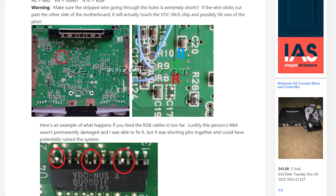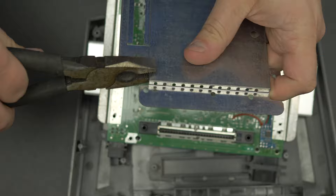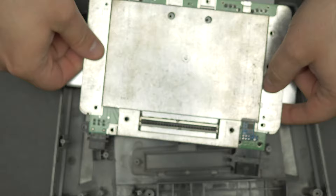I reused the wire but moved it to the correct SYNC pad — just check the installation instructions on RetroRGB.com for more info. Before you finish, make sure to bend the metal tab on the bottom plate before reassembling. If you don't, it could short out the RGB board and kill your console. The InTech gaming boards are shaped in a way that just misses the metal, but properly designed boards require that slight mod to the metal. If your N64 motherboard is one of the older revisions, converting or installing a properly made RGB mod is actually pretty cool — you'll end up with an N64 with a unique case that outputs all analog video signals safely.